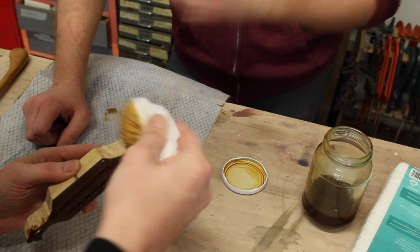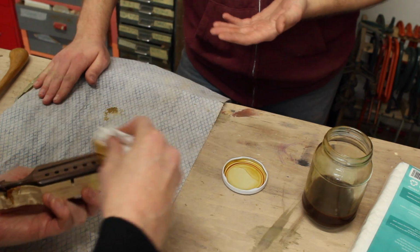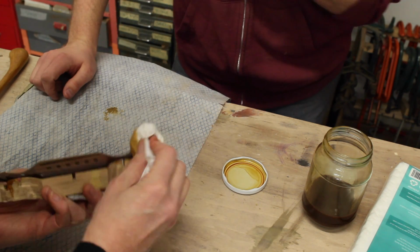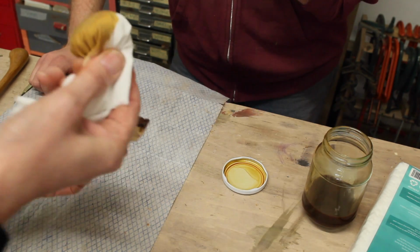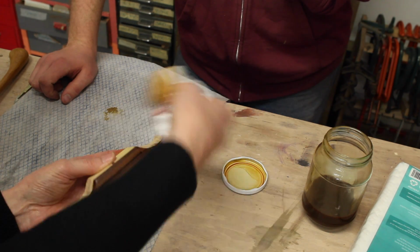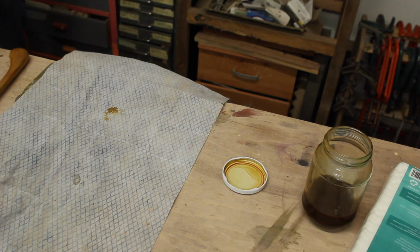At that point, you're pulling the shellac back off. So it's a matter of you put on plenty, let it dry out a little bit, then you're pulling it back, wiping it back. Tricky to get it round the edges though. And tricky to keep this on camera. If you want to come around this side.